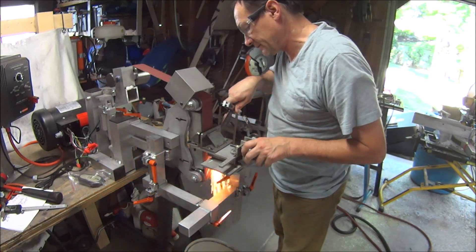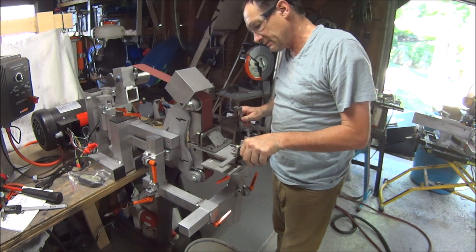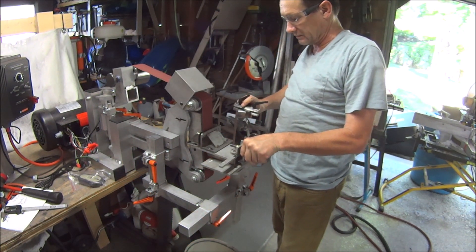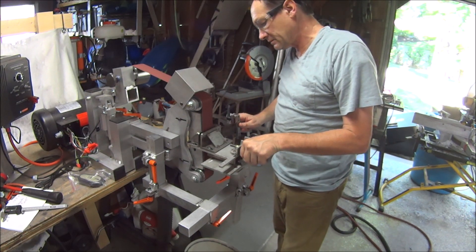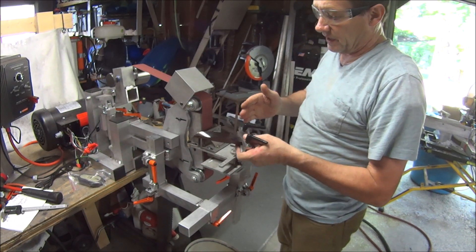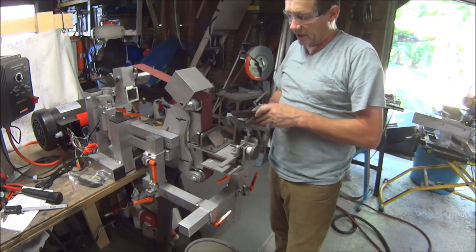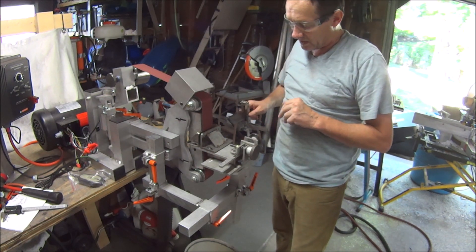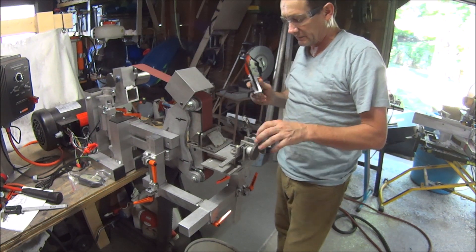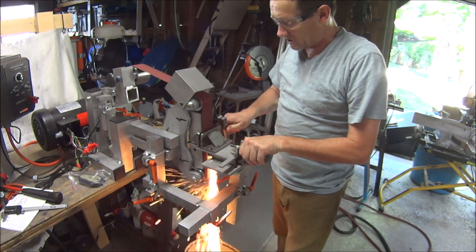You can't ungrind. No matter how many times you try to ungrind, you can't ungrind it. Now it's important when you're cutting to keep your motion side to side — if you're pulling or pushing like this, the blank is going in and out on the belt and it causes problems. You want a light hand and just go this direction. Don't let your hand ride or rest on it and pull it in or you'll mess up your bevel. That takes some practice. Practice on some cheap steel, practice on some plywood — if you can grind it in plywood you can grind it in a piece of metal.